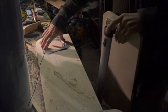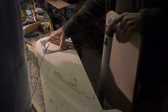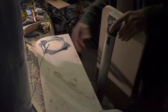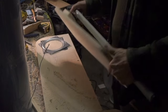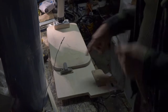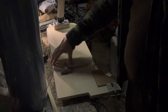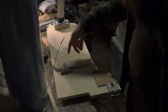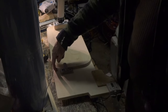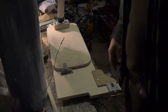Okay, I've just rebated the swivel into the bottom of the tabletop to make it a bit more flush, and hopefully it'll mean that the lower leaf will be a bit more sturdy. So laminate next. Okay, well, I've just found a latch for the lower leaf on the table, which will hopefully hold it in place a little bit. Might need to put a stopper in on that side as well, because it's usually going to spin around that way, but I think I'll add that as a modification.